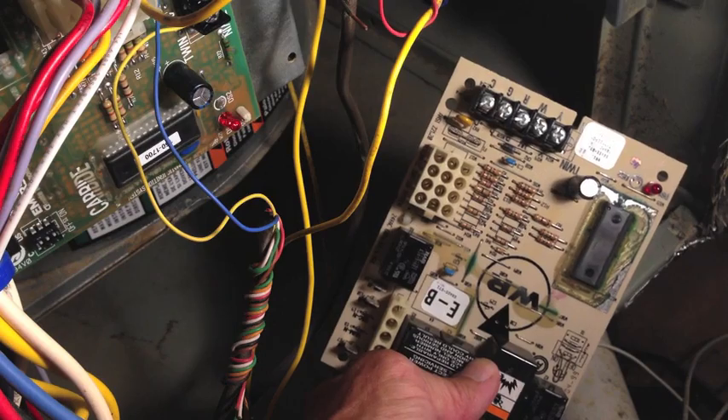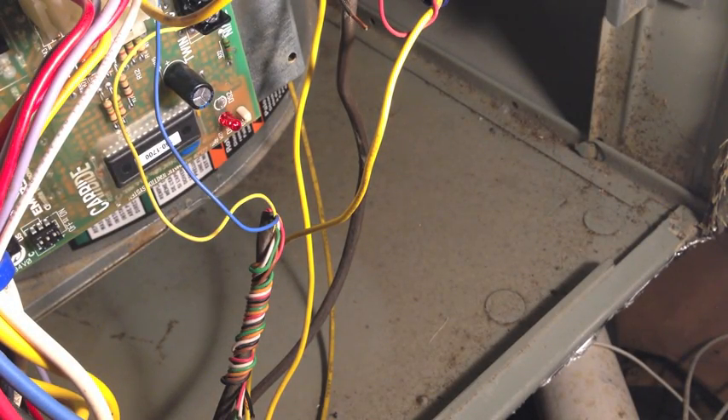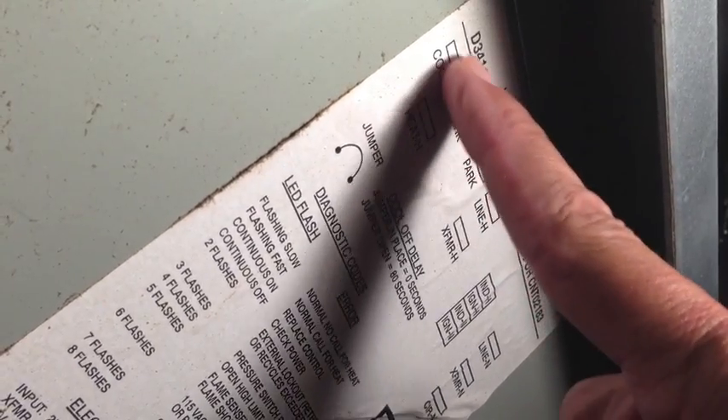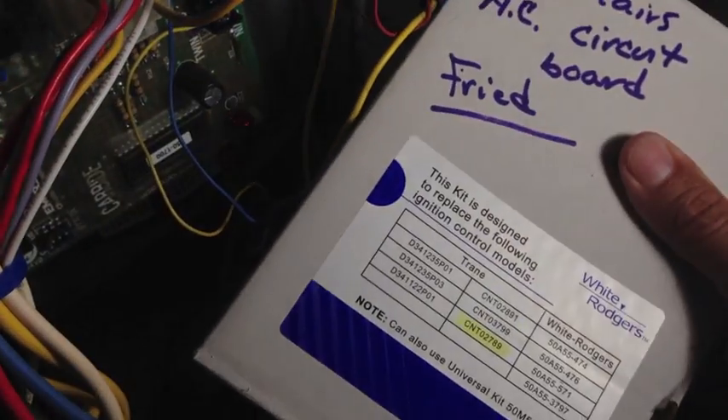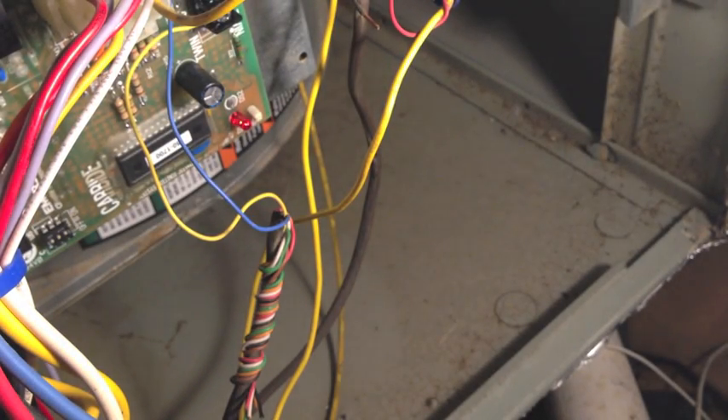Which one do you get? You can look for numbers on the actual circuit board, which I did. If yours is like mine, on the backside of the panel right up at the top, it says 'Integrated Furnace Control' and gives the number — replace with CNT 02789 or CNT 02183. Yours will probably be different numbers. That gave me a reference to find the replacement. There it is: CNT 02789 — a White Rodgers CNT 02789. Exact replacement. I ordered it for about $85 off eBay, got the new one in, and this is the new one installed right there.